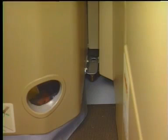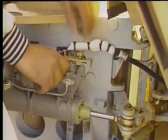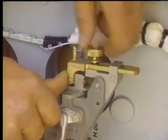Check the indication of the decorative cover brackets and girt bar visual indicator. Make sure that the operation striker lever of the door damper and emergency operation cylinder is in the armed position.